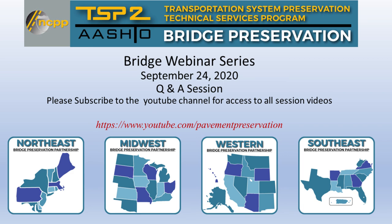There's a question on recommendations for placing three- to four-inch asphalt overlays on bridge decks — which overlay would be the best option when transitioning from asphalt overlay to another system? There's a lot of research looking at deck condition of bridges with asphalt overlays, and it's hard to see what's going on underneath. When you remove the asphalt overlay, you need to assess the deck condition. The limitations are related to thickness — maximum thickness of LMC, not going very thick with thin overlays, though polyester polymer concrete can go greater than four inches if needed. But you do need that sound substrate.